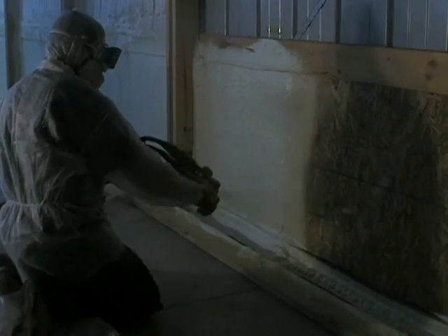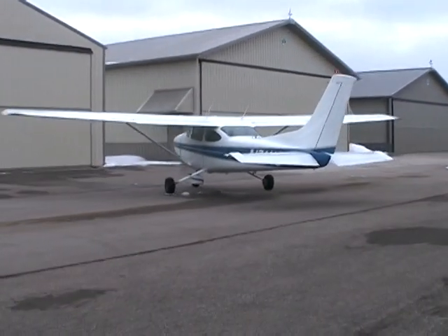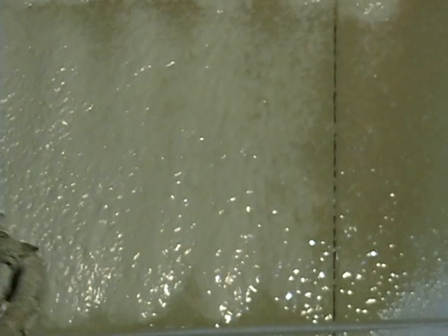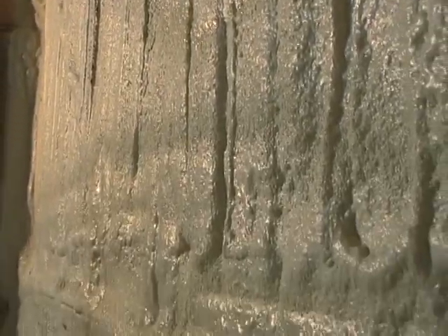The primary reason we're insulating this particular hangar is in order to get the airplane engine to start reliably and without a lot of stress on the internal components. It's really nice to have the engine around 40 to 50 degrees. And if you want to go out flying during the colder time of the year in this climate, we really need to have some heat in the airplane hangar. That heat can be very expensive if you have no insulation in a steel building.